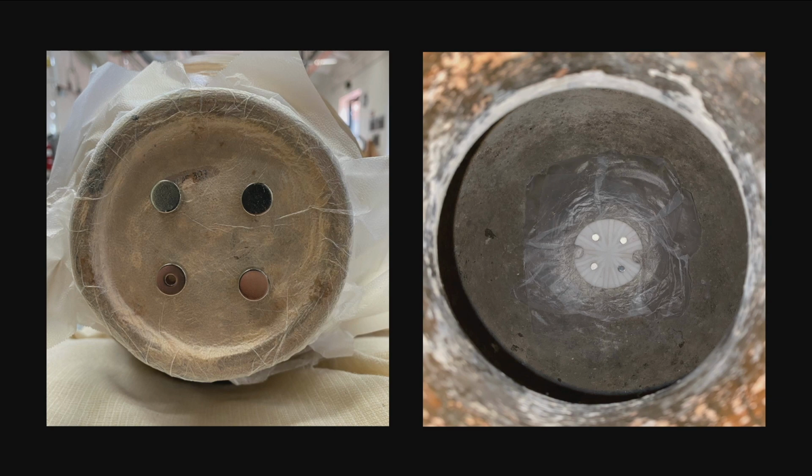Here we have a lot of volume. So the reality is you can do a lot of magnet stacking on the type here so that you can determine and dial in the pull strength that you need. But the idea is, in order for you to understand what you need in terms of the size of the magnet as well as the placements of them, of course, what is possible in terms of the cavity you have on the most limiting one, which is this one here, but also what are the forces that you're trying to deal with. You have to define what you're trying to do, and you have to define basically what is the weight of this object.